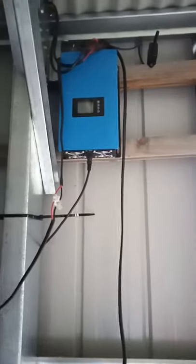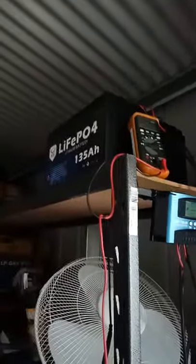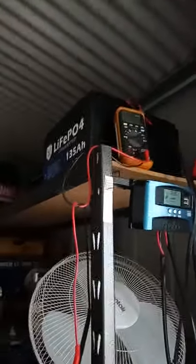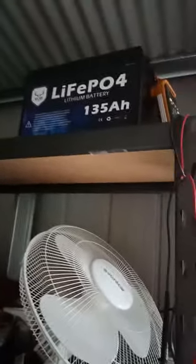In the morning it turns off at seven o'clock, which is about when the batteries are flat anyway. It turns off and allows the sun to charge the batteries during the daytime. The idea is to have a cycle of around 3 kilowatt-hours — I should be able to store 3.3 kilowatt-hours in those two batteries if they are genuinely 135 amp-hours.